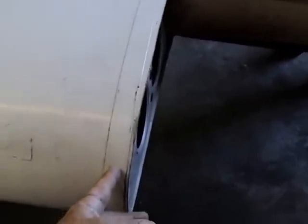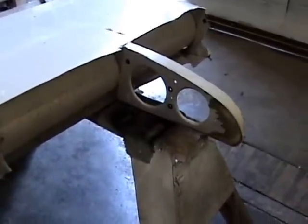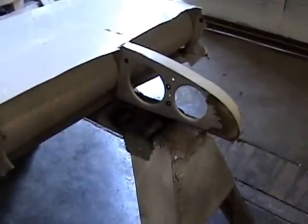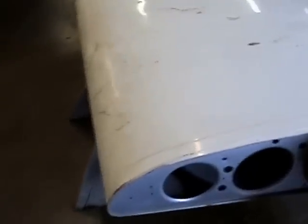Moving on, we got the strap off the middle. This one over here, we're going to use this section here. I have to heat up, delaminate this strip off of here, because this is the wing that had it bonded down where that one was riveted down. And that'll expose the gap underneath of this. And then over here is a rib we'll use to sister up against the one that's in there to give us our flange that we need to rivet to. So we'll get more on this as it moves along, and job's underway.